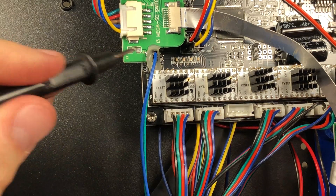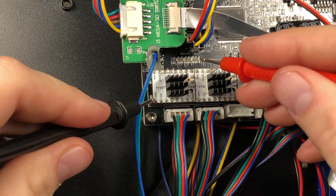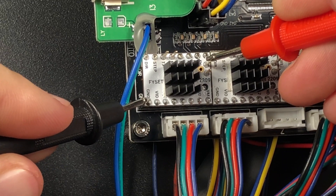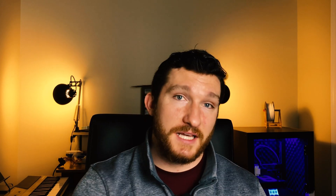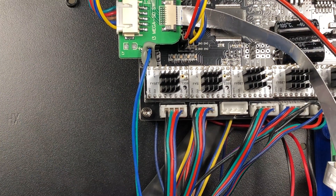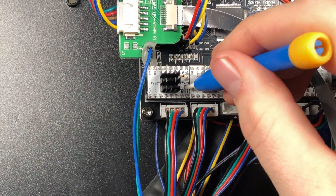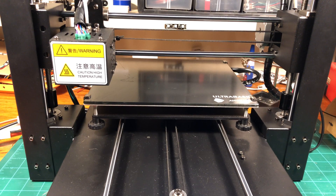The next step is to calibrate the reference voltage for the new drivers. To do this, power up the printer and measure the voltage difference between ground and V-Ref with a multimeter. All the sources that I found online claimed that 0.85V was the most accurate voltage reference, so that's what I went with. To adjust the reference voltage, use the plastic screwdriver that came with the drivers and spin the onboard potentiometer left to lower the voltage and right to raise it. Once you have all the drivers calibrated, flip your printer over to make sure everything's working as expected. You should notice that your printer is already way quieter.